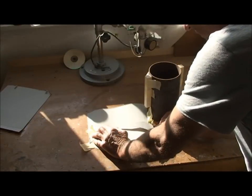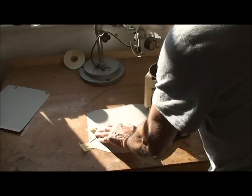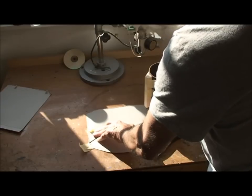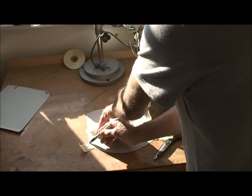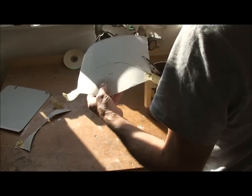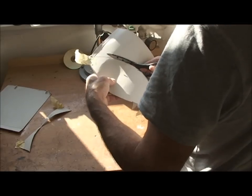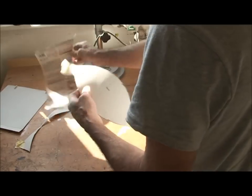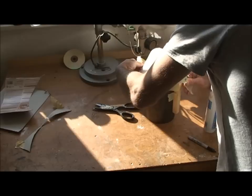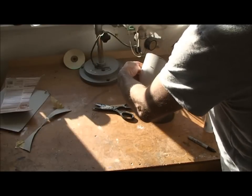You need about three-quarters of an inch on this edge, and that's where you're going to mount it with a couple of rivets. Put the edge of that onto there, then draw that over and cut that out. So you end up with that shape — and really, that's the hard work done. You mount that one on there like that, and that's your first flute.